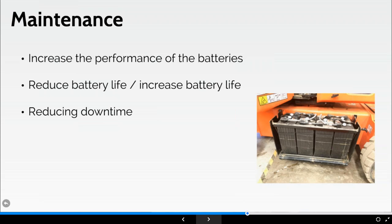I only need to touch a very short distance from one of the terminals, which may be potentially exposed to that metal battery clamp or that side, and I potentially could cause myself to weld to the battery for starters, but equally could cause an explosion. So things like metal rulers, screwdrivers, that sort of thing. Of course, improper fluid levels or damaged cables and connections can result in component damage and potentially hazardous conditions. So nice and steady, take your time, think about it.